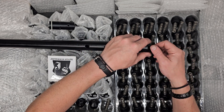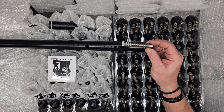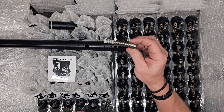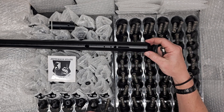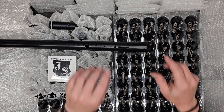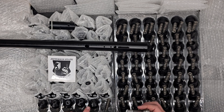That spring stopping guide could just be threaded in. You don't need the spring stopping guide for the twin spring systems, but in order to install it, you will need an end cap that has been modified — whether you drill and tap that out yourself, get one of these, or contact me if you don't want the twin spring system and we could figure out just the end cap.